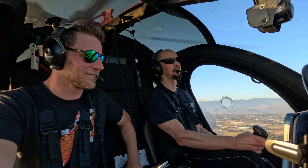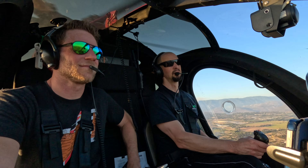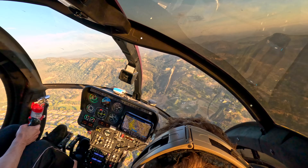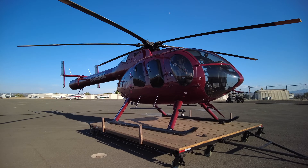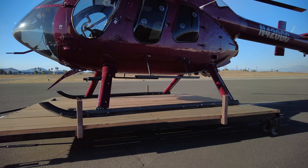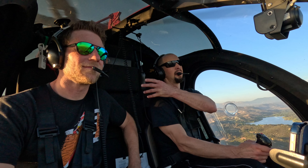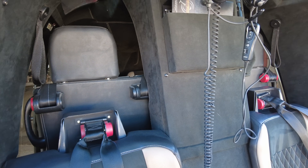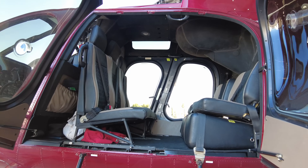The reaction time on it too — when I was up in Big Bear, a hawk came straight at me at the base of the hill and when you move the cyclic this thing reacts fast. Six-blade rotor system — this thing reacts fast. Also in the MD, which is a big selling point, is the frame. This is one of the most crash-worthy frames in the industry in a light duty helicopter. It's a semi-monocoque frame with an A-frame truss right behind us built in as a kind of backrest. These have a very, very crash-worthy frame.